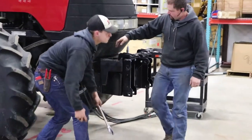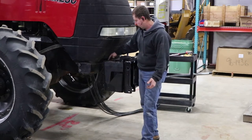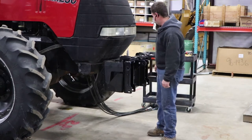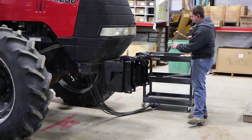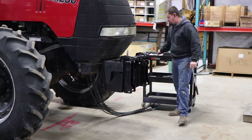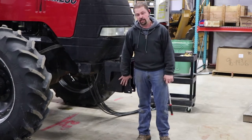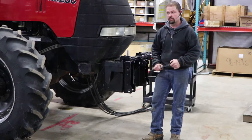What happened here is our plate on Dalton's side didn't drop down — it was actually sitting on the tip of the forklift — so we simply loosened that bracket up, gave it a little adjustment, and allowed that plate to slide down. All the hole sizing is just a little bit big, so there's some adjustment room in the system itself; otherwise it gets very frustrating when you have to drill those holes out. The next thing we'll do is go ahead and tighten everything down. You'll notice we have our top hook, which is Part F on the diagram. We have our top hook on there but left it loose, and our below weight bracket stops are on but not tightened down. The system is designed to be put on and then simply tightened down, kind of like saddling a horse where you cinch it down and get everything good and tight.